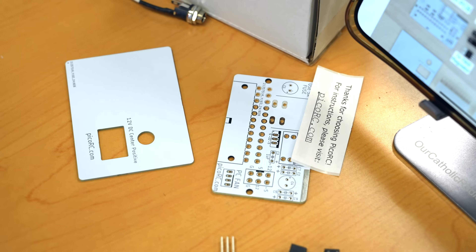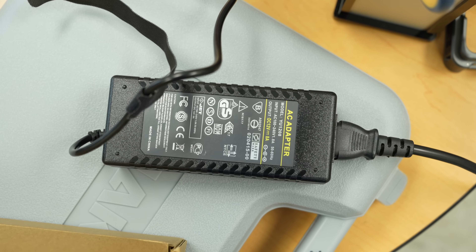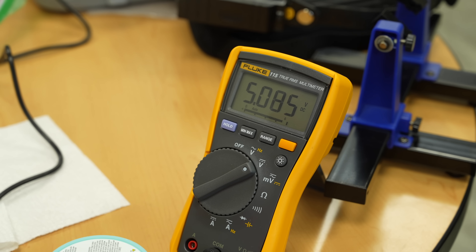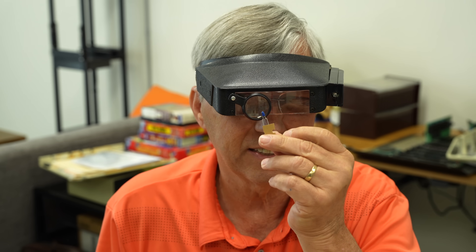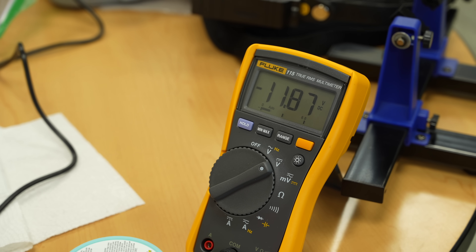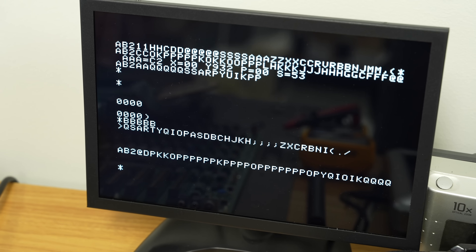The new PSU was a great option. We bought a Pico RC — it's a tiny power supply using a Pico PSU. You rely on an external 12-volt power supply, plug that in, and it feeds the five volt, negative five, twelve, and ground rails. We verified all the rails with a volt meter and they were good, but then we started getting some weird boot errors and the sound would get choppy.